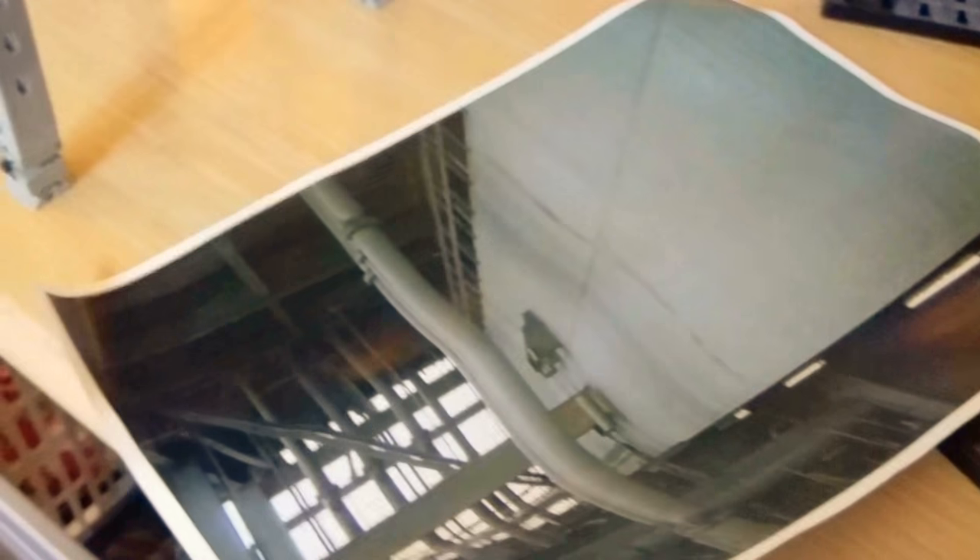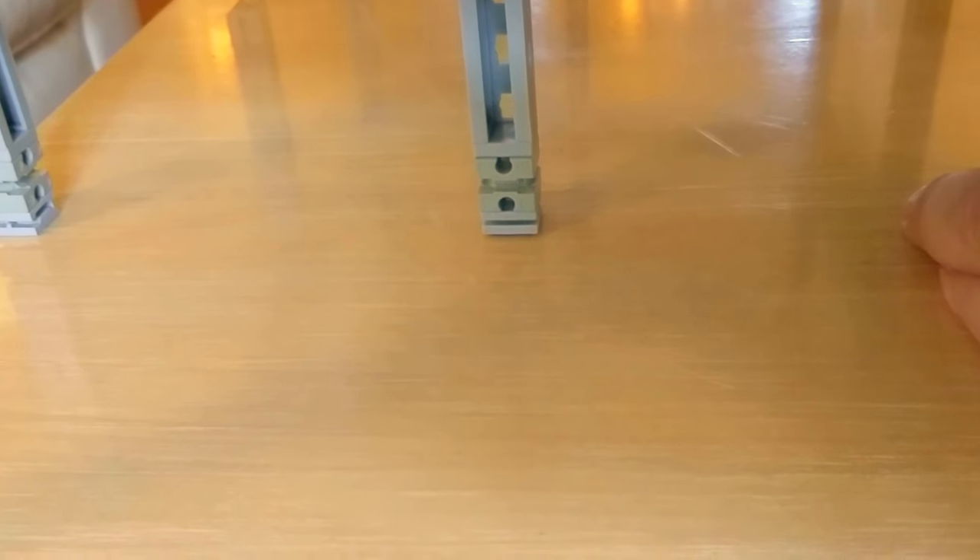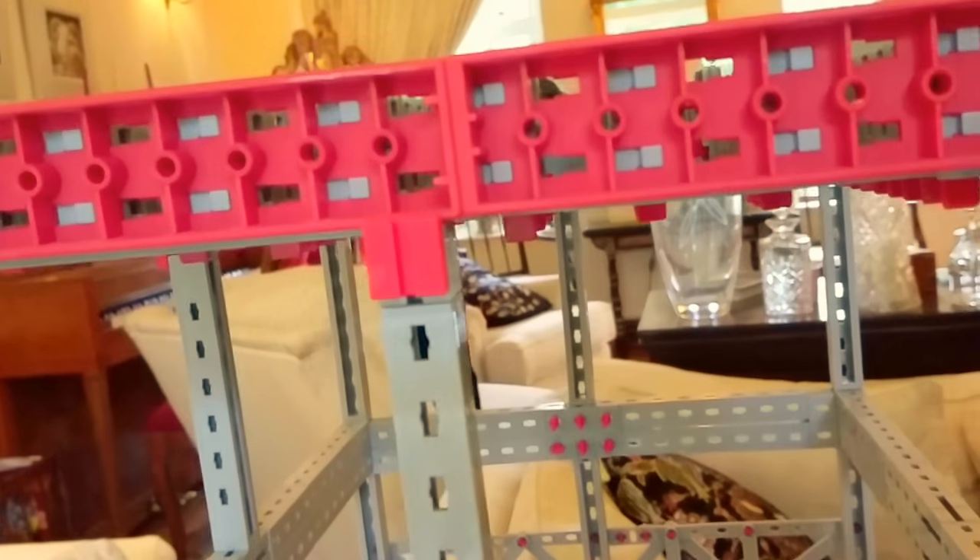The problem with the three columns I'm talking about is that there was this incredibly rigid beam that went across the top of all three of them. That beam is 16 feet by four — I've seen the drawings. Standing on tiptoe, I was level with the bottom of it and couldn't even touch the halfway weld joint. That's fantastically rigid.